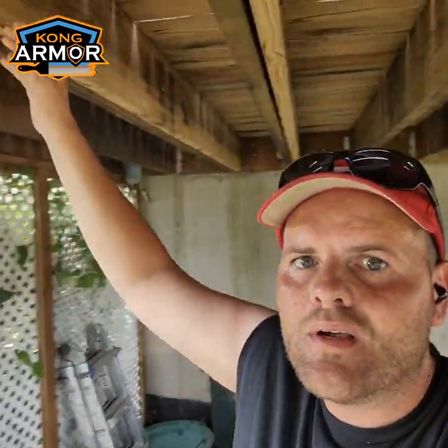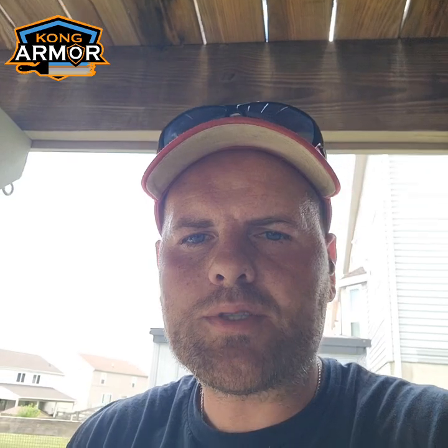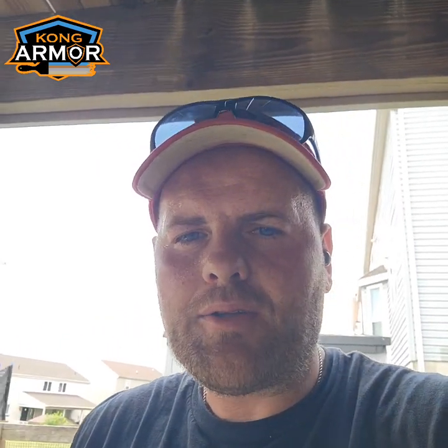We're going to sister these up, but the thing is, I've seen so many people this last year, I've met with them and got quotations, who have small areas of rot in their joists like this. Very tiny, not a big deal, right? We just tag a new sister board to the side of the joist. Look, it runs all the way. No big deal, 15, 20 minutes, you're fixed up. I've seen so many deck owners tearing down their whole structures. Seriously, somebody will come out and talk them into tearing down to the frame, $20,000, $40,000 over this. Not necessary. Giant waste of money, right?